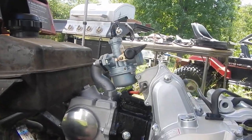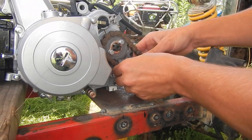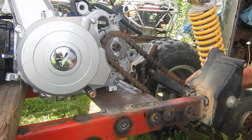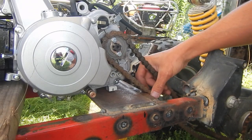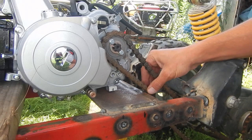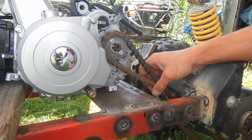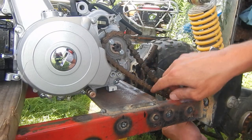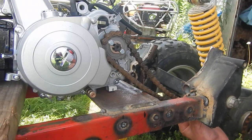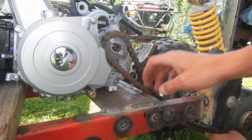I'm not putting a fuel pump on this thing because that adds its own reliability issues. And here's issue number two - not really a mistake I made but something I short-sightedly didn't notice. When this chain is going to run down to the sprocket, there's a little collision issue right here. So I think what I'm actually going to do is cut this plate in a bit and slide this motor back an inch or two, so at full axle droop my chain will be about there. It'll probably still slap this piece of metal a little bit - I can protect it with a chunk of nylon or a flat-faced idler pulley mounted below there.